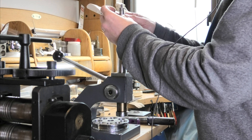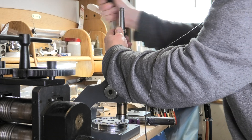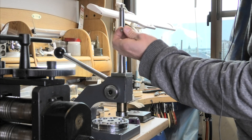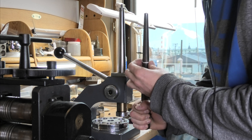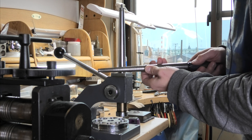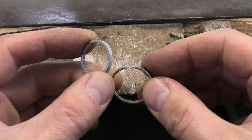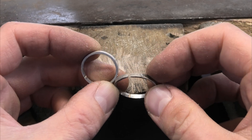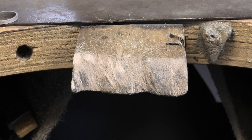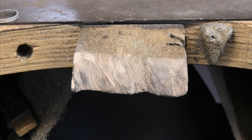Now the solder paste ring — starting with the join right in front of me, same technique, same amount of pumps. Oh my god, yes it is so much more brittle. That broke really quickly — it broke at Q, pretty much dead on Q. So that's a big difference: six sizes difference. Close look at these — that's quite amazing. I don't think I've ever seen that happen before where the join was not the weakest part of the ring. I'm almost skeptical — is there porosity in there? No, it just looks like it stretched and gave way.